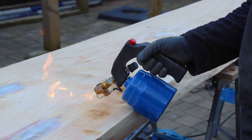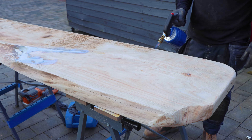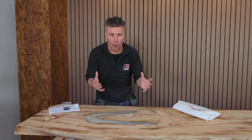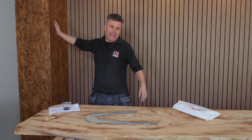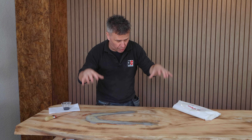With my wood drying out and sanding down quite lightly, I'm deciding to scorch it a little bit with a blowtorch. This is a quick and easy method to darken your timber. I brought the planks in from outside — all the heating, the scorching or burning around the outside is now complete. I wanted to try and get a bit more of a darker wood. I wanted a nice smooth finish, but I wanted to blend in with something like this, or even this behind me here, because it is going to be living in this room — it's the office table for our new office.